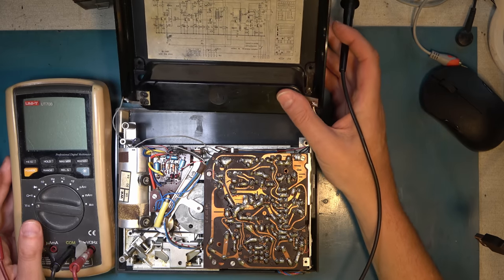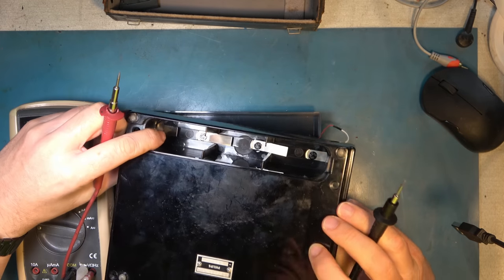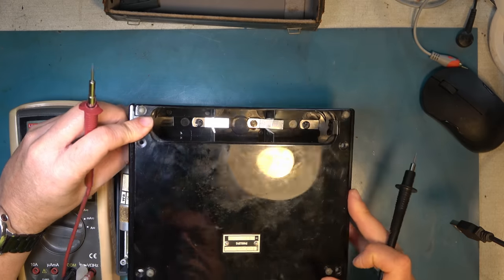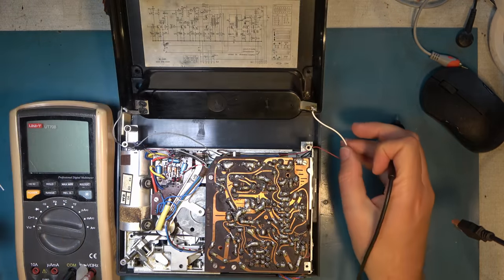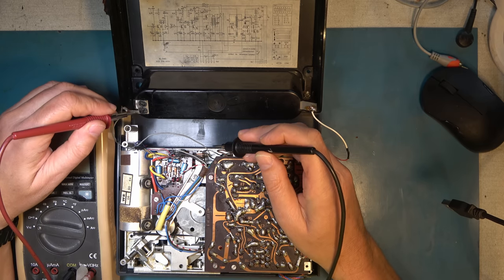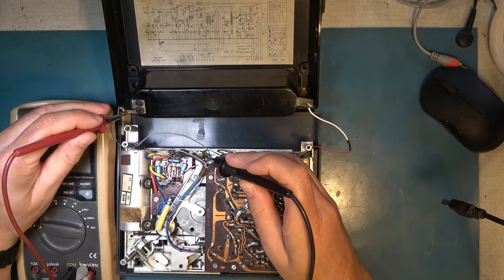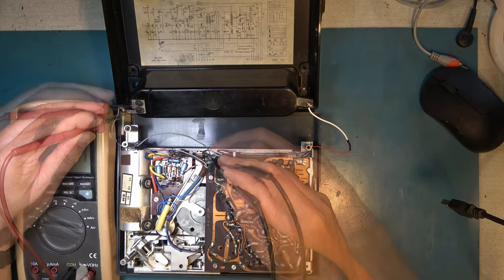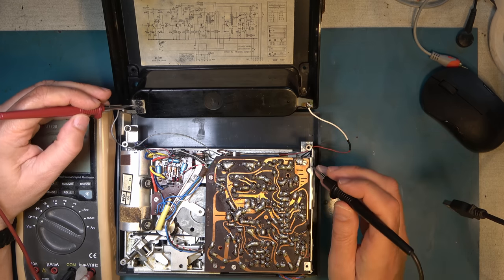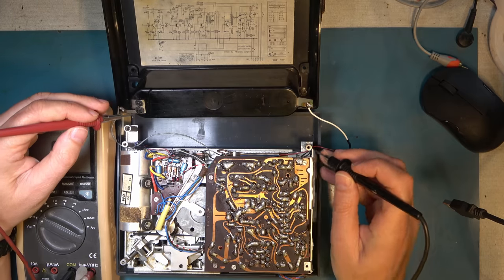Sometimes something simple turns into something complicated. So here's the tape - it's got this pull-through thing, there's a lever on the deck that pulls that through. But it's a weird size so it won't play on a normal tape deck. So I have to fix this heap of junk. You have to set yourself in the 1960s - everything was back to front in the 1960s. Remember positive earth cars? So I think this is a positive earth system.